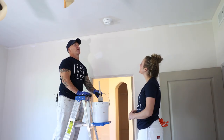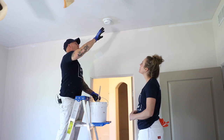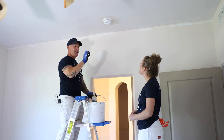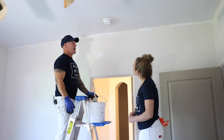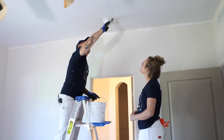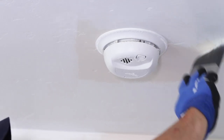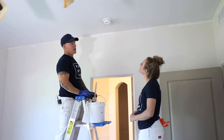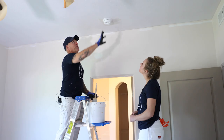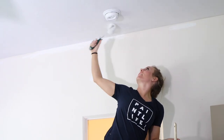With the power roller or inner-fed roller, we can't get close to fixtures like the ceiling pan, the alarm, or the edges of the ceiling. So we want to brush all of our edges — just take it down about an inch down the wall. Once that dries we do the second coat, then we roll the walls and hand cut in the ceilings. Be very careful painting around fixtures — don't get any paint on them. Use a nice soft brush, do two coats. We'll use a four-inch roller to back-roll after brushing, because just brushing leaves brush strokes that won't match the stippling of the ceiling.